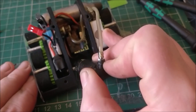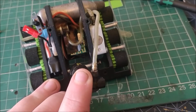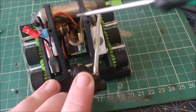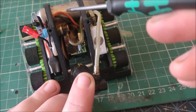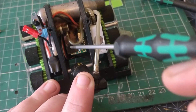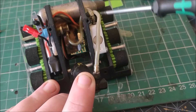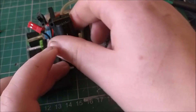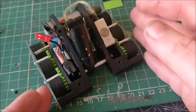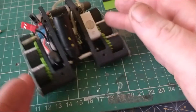Going logically through the system, we start at the fill valve, which is coupled to the air tank at the back. Air is pumped into this and is held in the tank. This is then connected to the firing valve through some air tube. Once the switch is depressed, the valve opens and allows air to transfer into the ram, firing it. The spring return then brings it back.